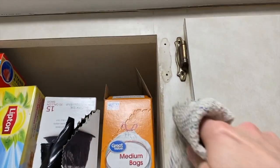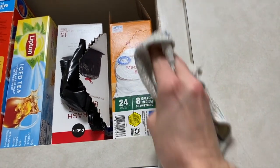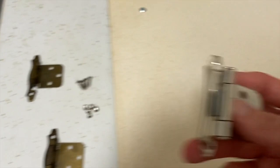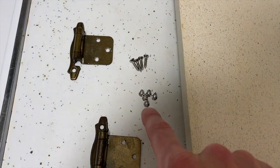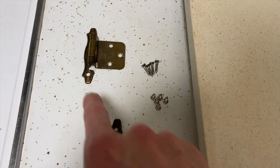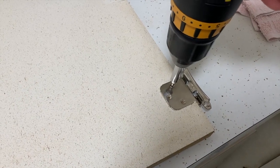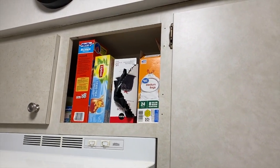Not bad. Now it's time to install the new hinges — I might clean that a little bit more prior to installing. Comparing the size differences again: all the screw holes match up but the new hinges are slightly shorter. Everything lines up — we'll re-secure the three screws to secure this hinge to the door. The pack comes with several short screws and a few longer screws: the longer screws go on the outside of the hinge, and the shorter screws secure the inner flat plate to the inner portion of the door. Door hinges are secured — we'll reposition the door, align the screw holes, and secure the screws.